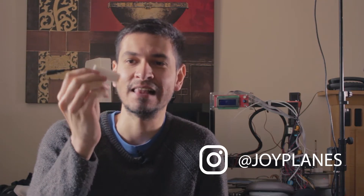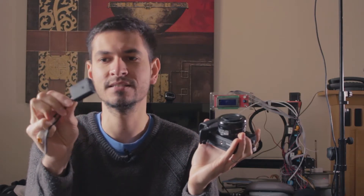This battery life doesn't suit me at all because I use the camera a lot shooting inside, recording how-to videos and stuff like that — very long shoots — and this battery is very bad for that job. So what I did is I built my own little device that allows me to plug a battery in one end and power the camera by another adapter I had to buy from Amazon or eBay. This plug connects to the outlet and converts the electricity to the voltage that the camera uses, and I have an adapter in the shape of the battery, so this fits my camera and powers it for as long as I want.